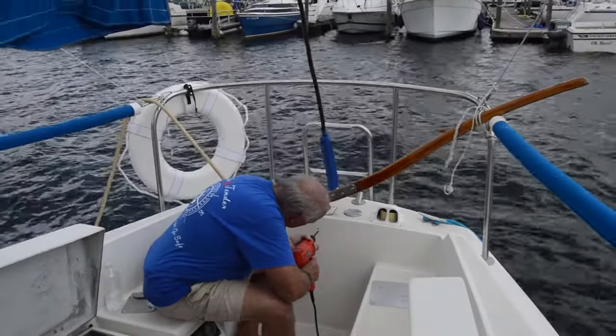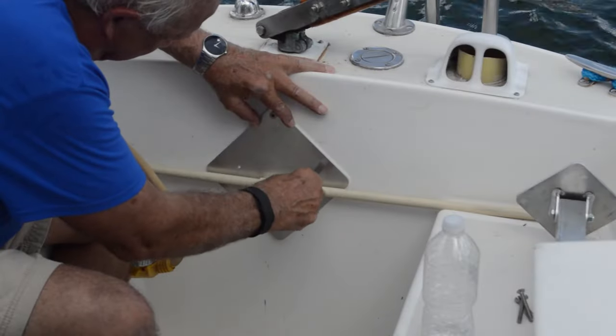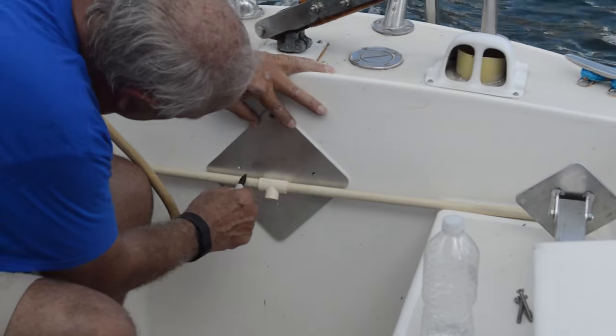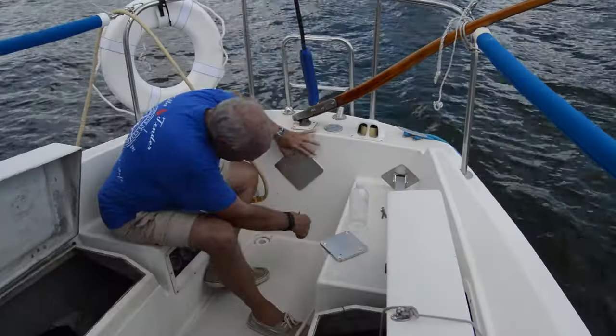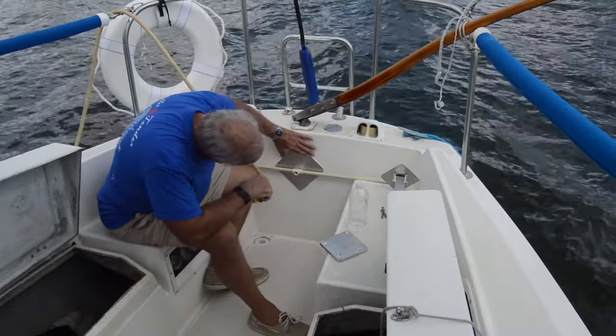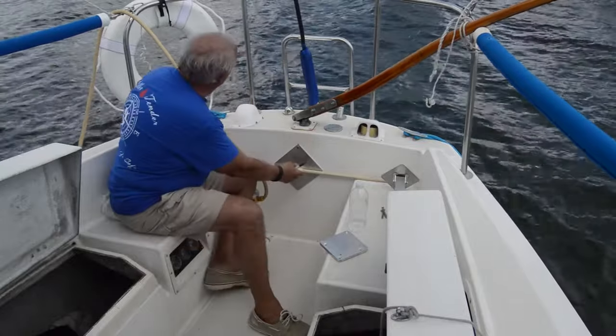Return to the dock. Drill a pilot hole using a 1/4-inch drill bit where the small mark is and put one of the mounting bolts through the cockpit pack and hold the backing plate in order to mark the other holes. Use a straight bar or device to make sure the backing plate is level when marking the remaining holes. Do not use a level.